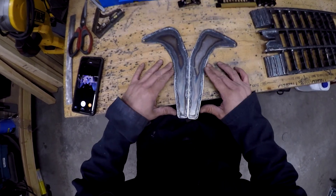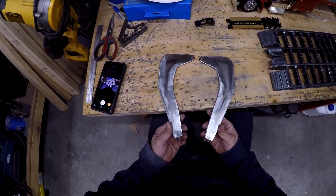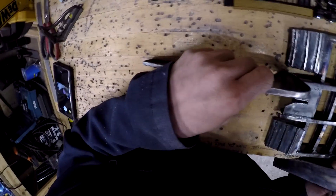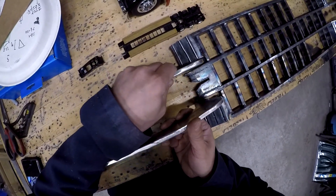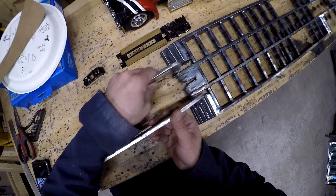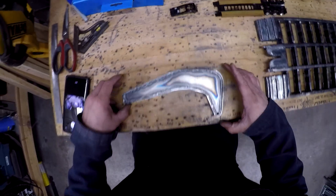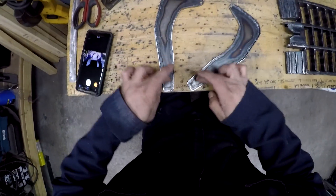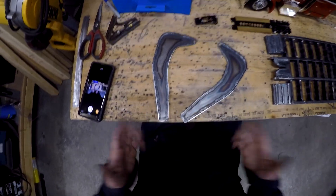Well, that's all I'm doing today. My hands are tired from holding that grinder and welding. You can see I put my tapers on the ends so now they have plenty of room to fit between here - that way I can guide them in and if I'm a little off it's okay. Nice mirror images of each other, no warping. They had warped but I used a mallet and the vise to straighten them back out.